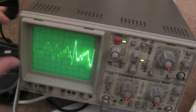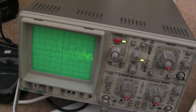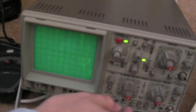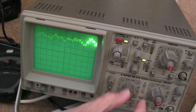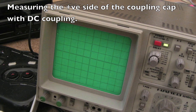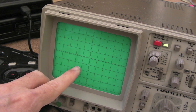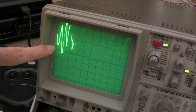The fact that that cap is DC biased — this signal is shifted right up. I can show you that. If we switch the dual off and just put it on channel one, I'll probe the other side. I'll leave it on AC coupling just to show you the signal — so that's on AC coupling on the input. Switching onto DC coupling — you can see we jump right up here. Does that make sense? If I lower the voltage it should be a bit more visible. So that's our ground level and we are well above it at this point. You can see we're on DC coupling — ground level is bang in the middle, as I'll show you in a sec. Now when this intro music starts here, this is a good example of where it clips a reasonable amount into the negative side — you see that? Not very much, but still, you can see it clipping.